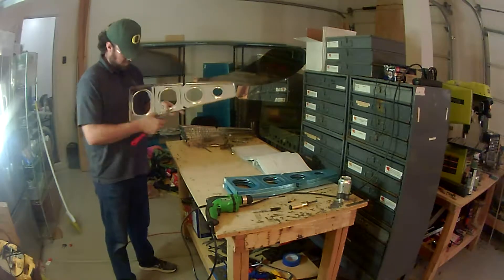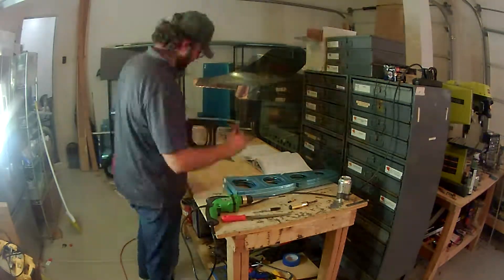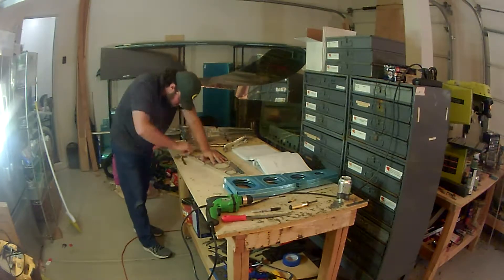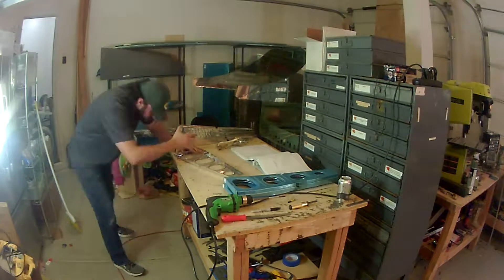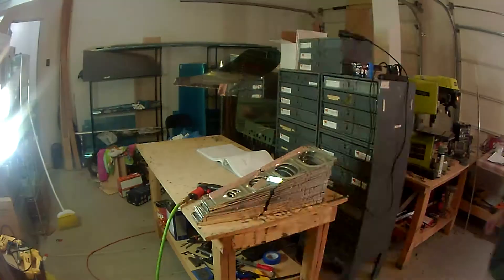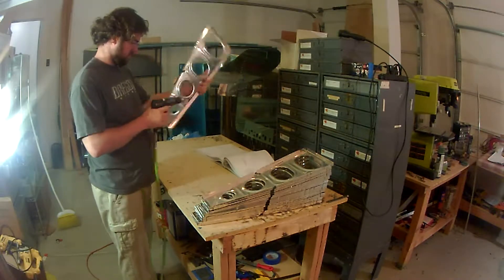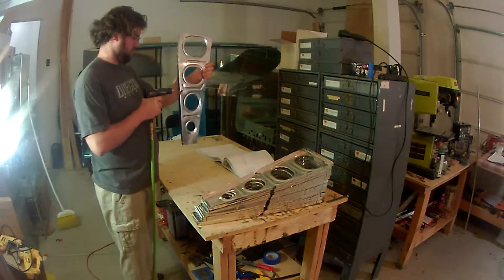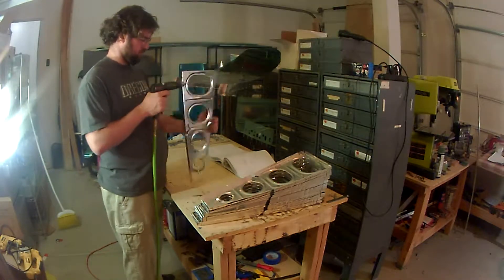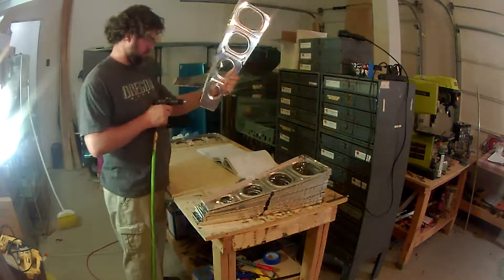As you can see on the far end of the table, those are the completed ribs. This is showing the steps of using a right angle to verify the flange angles, then using that flat tool to fold or manipulate the flanges to make them straight. Then you use the fluting tool to make the ribs as straight as possible. The instructions then have you final-size to #40 all the holes on the bottom and top flanges to get them ready for the skins.